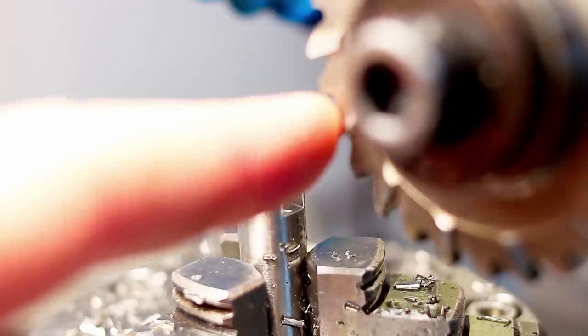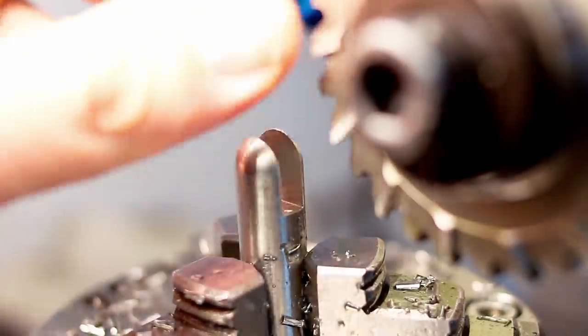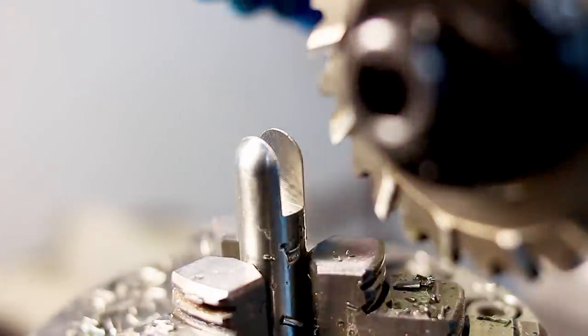And secondly, that's also the sign that we used a staggered tooth wheel cutter, because the saw blade would not leave the side wall finish, since these teeth cut on the side and the tram is perfect. The teeth will cut when the wheel enters the slot, and when the trailing cutting edges come into contact, they will again scratch over the surface. Yeah, the scratching could dull the cutter, but in reality, that's no problem.